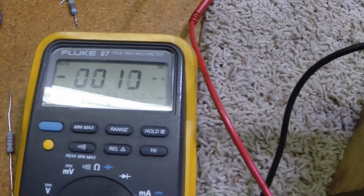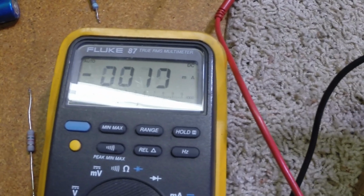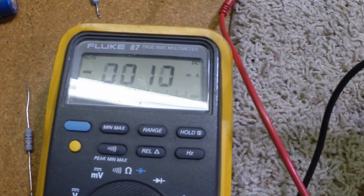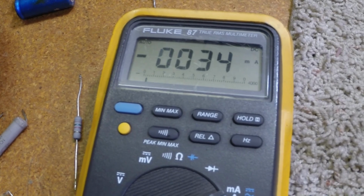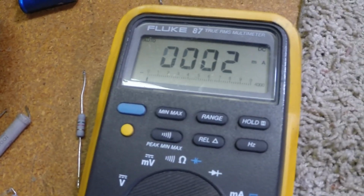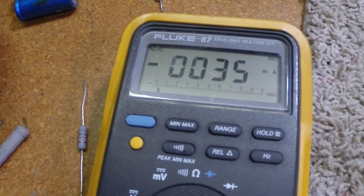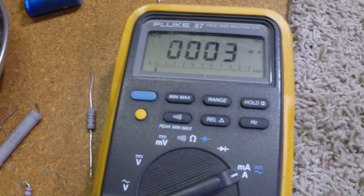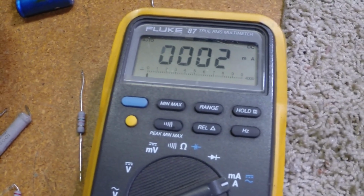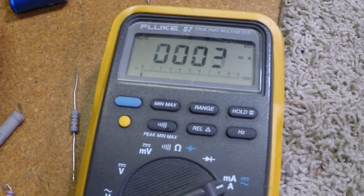So, the next move is to see what our plate current is. See if it's changed any. Okay, our plate current has come down a couple mils. That's good. We're now at 35 mils. Was 37. Target range is 34. This is great.